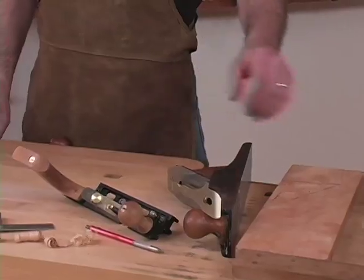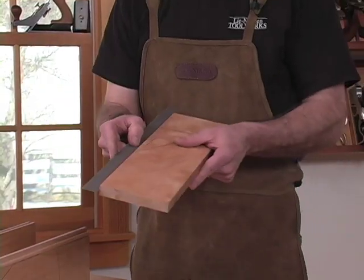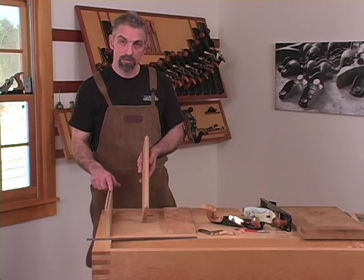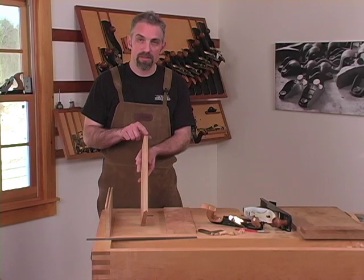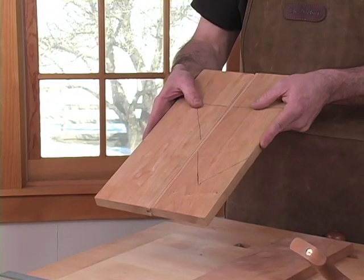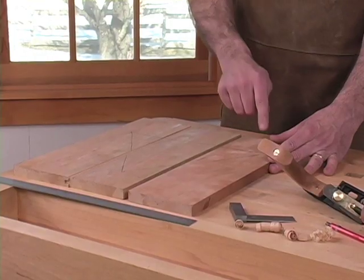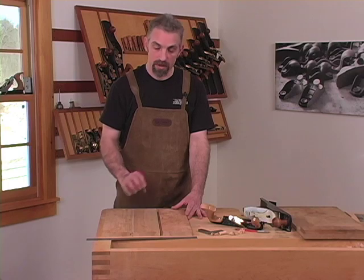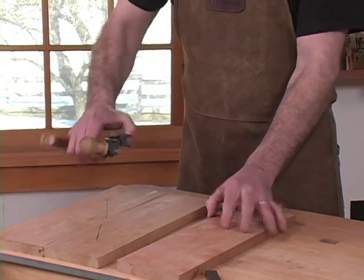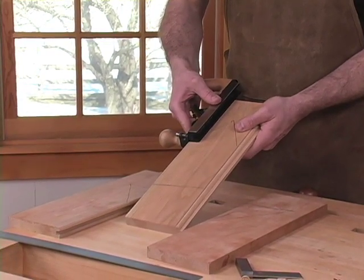Now let's talk about stock prep. I've already prepared my stock. I was careful to make sure that the edge is square and straight where the joints come together. This guarantees that when I cut the tongue or the groove, I'm going to end up with a square edge — not an angle to either the tongue or the groove. That guarantees a flat surface rather than a cupped surface. The other thing that's important is that I'm referencing off the same face of the boards. I've used what's called a cabinet maker's triangle to help me orient which side of the board is my face side. When I then make my cut for the tongue or the groove, I'm referencing off one side, and my marks tell me where the reference side is for when I cut the opposite piece.